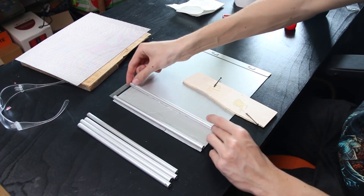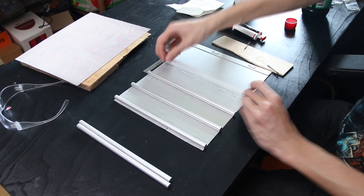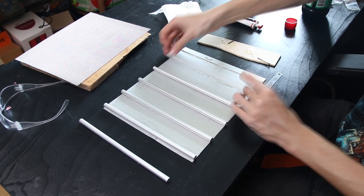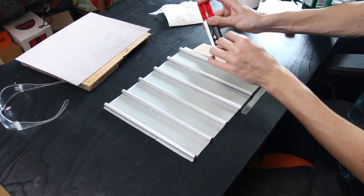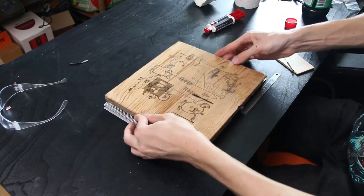In order for the air to actually go somewhere once it has cut through the material, I created a perforated aluminum base. I used some mesh aluminum on top with spacers and another aluminum sheet on the bottom. The reason I used metal is so it doesn't melt or get destroyed by the laser like wood would. It's not quite ideal but I was using materials I had on hand, so for that it worked out pretty well.